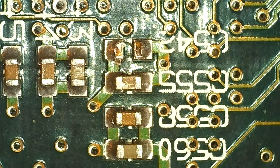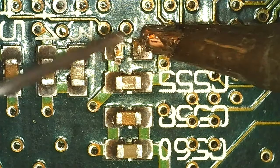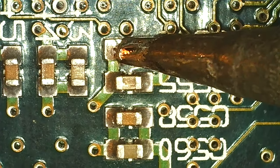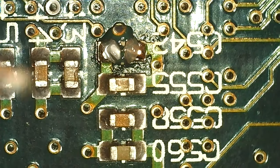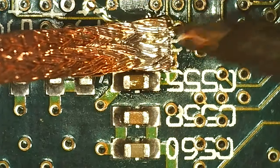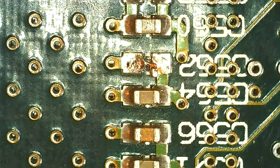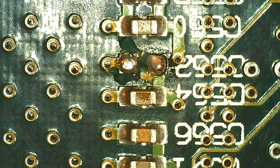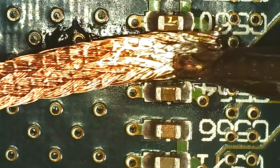With actual heat in the iron it's much easier. There were some old ceramic fragments left on the cap pads — that's sometimes an issue when they've been knocked off; it gets between the wick and the pad. We're at the GPU now, with two broken caps there. You can really see the ceramic parts — annoying to wick without removing that first. I should have a smaller wick but it is what it is. I think this is the last broken one.